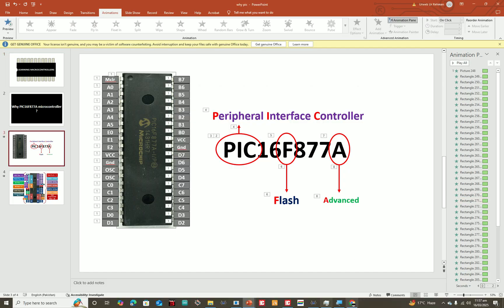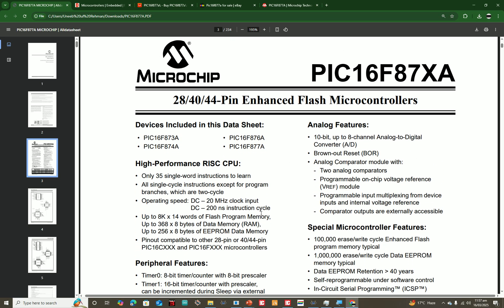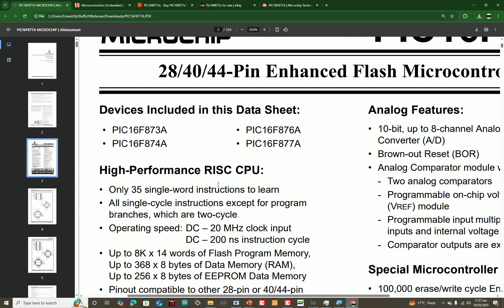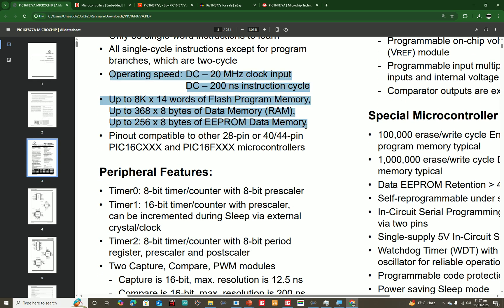Let's go to the internet to see live — as of Sunday, 16th March 2025. Here is the datasheet for the PIC16F877A. First, it features a high-performance RISC CPU. The maximum clock is 20 MHz with a 200-nanosecond instruction cycle. For a cheap microcontroller, these specs are huge. You have 8K of flash program memory, which is also huge — you can connect various sensors or modules, even a fingerprint module, and do a huge amount of programming in this small yet very powerful microcontroller.